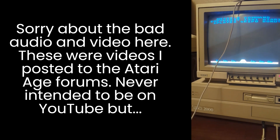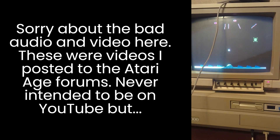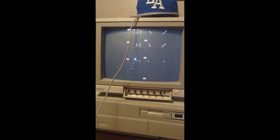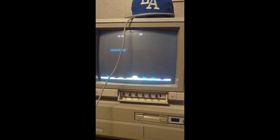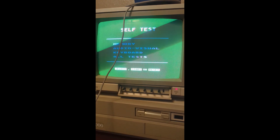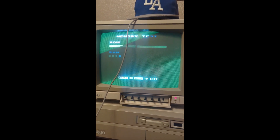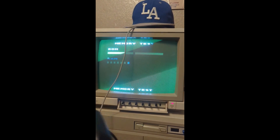We're in Missile Command now — it runs just fine, no graphic glitching. As soon as I hit the button on the joystick, that's what happens. The sprites stay where they should be, everything looks right, but yeah, not good. Now in the self-test, doing a memory test — RAM passes, ROM passes, everything works fine. However, watch when I hit the button again: the words on screen start glitching out.